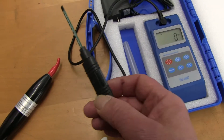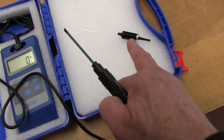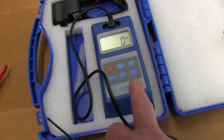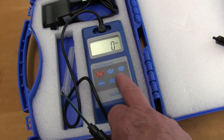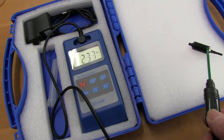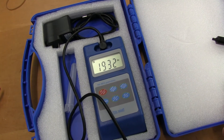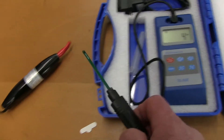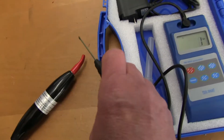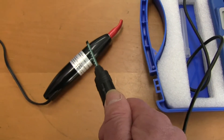So is that strong? Well, it's not that strong actually, because here is a DC rare earth DC magnet from a little electric motor. I'll just switch this to DC and check the gauss on this — 1,700, so that is a strong magnet. Let's change back to AC and check this one — 140. So it's a massive difference; this isn't actually that strong compared to that.